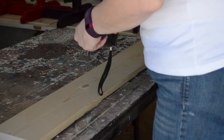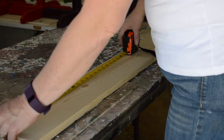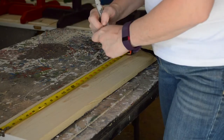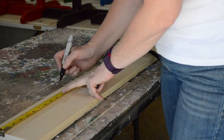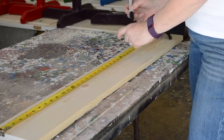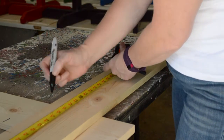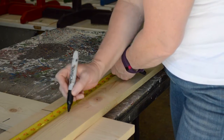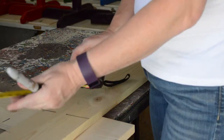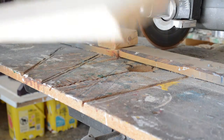What I'm doing here is measuring off on the wood the pieces I'm going to need. I'm marking at 12 inches and also at 24 inches — these will be the sides of the grooming box. The bottom I did at 22 inches long, and for the front and back sides I kind of eyeballed it once I had the other pieces; they were around 23.78 inches long.